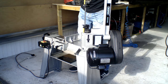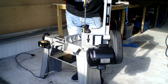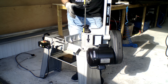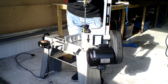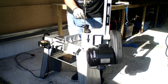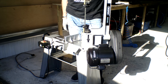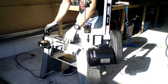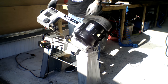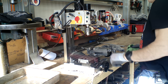There are some bearings in the housing - top and bottom - that the main pulleys run around. When I'm just giving it a general clean I don't bother having all the covers off, but about once a month the covers come off and I make sure there's loads of grease packed in there. I don't want to be squirting oil all in there and wiping it down because I don't want the blade slipping. The blade is held under tension between two big pulleys - one here and one up top. You really don't want it slipping. Just cover it, wipe it down, get rid of all the shavings - job done.